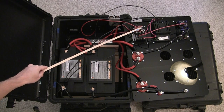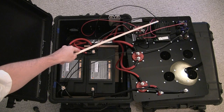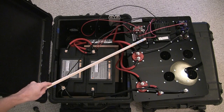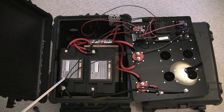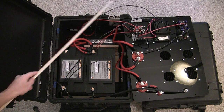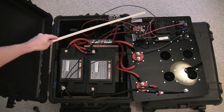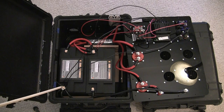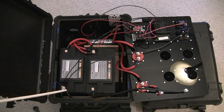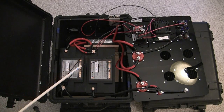Looking at the first wiring path: the positive lead comes in from the solar panel to the breaker panel, then out and over to the solar controller. The negative lead goes directly to the solar controller. Coming out of the solar controller, the positive cable goes back to the breakers, the negative goes over to the battery, and the positive comes back out of the breakers to the batteries — that's our charging loop. Also coming off the solar controller is a battery temperature sensor that wires down to the negative lead on the battery.